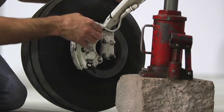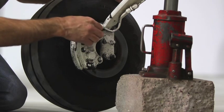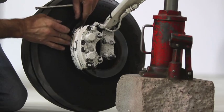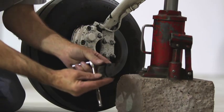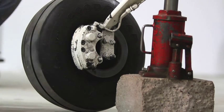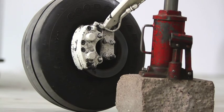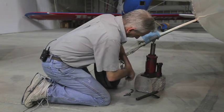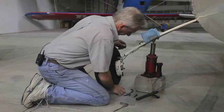Some other model aircraft utilize only one piston per caliper and only have two bolts holding two brake pads. You'll need a 7/16 wrench or socket to remove these bolts. Don't remove the two inner nuts that may appear to hold the caliper on. These nuts hold the adjusting pins that float on the torque plate, allowing the assembly to move as the brake pads wear in service.